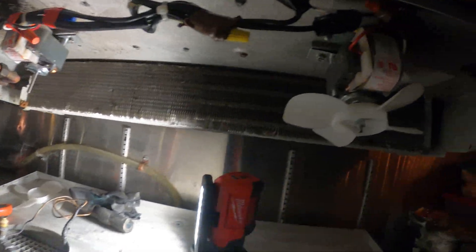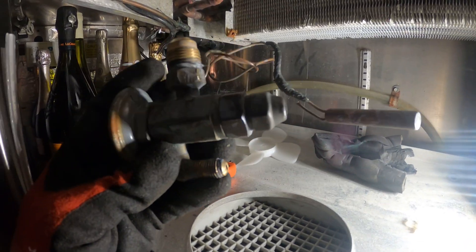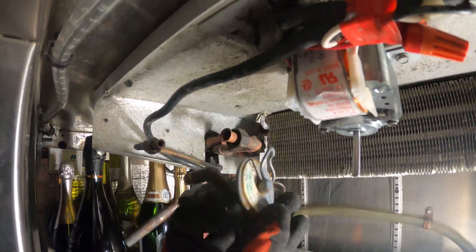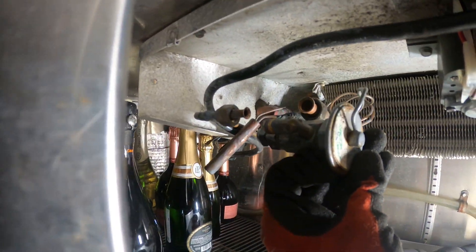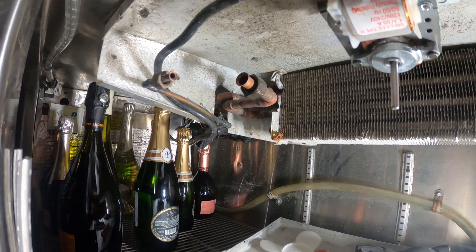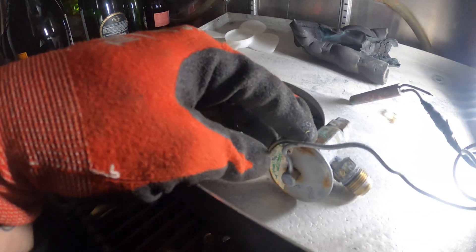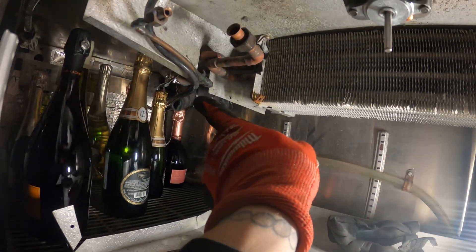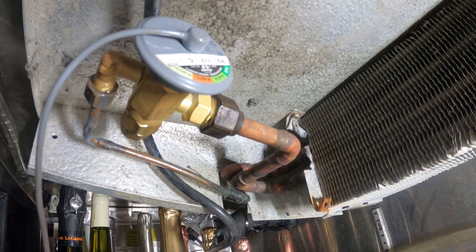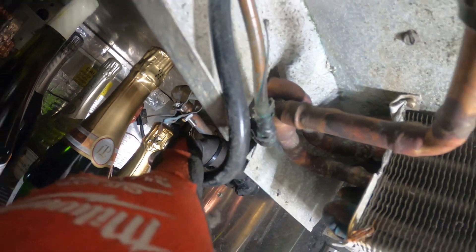Here we have the blower section. I took off the blade just so I have a little access. This was the expansion valve I took out — they're also both flared. Before I came up here I shot nitrogen through, just in case anything got lodged in there. We're pretty much just going to tighten down our two flare nuts on here and strap the bulb on the line. Here's the new valve — let's tighten down the two connections. This bulb is going to get strapped on here and then insulated.